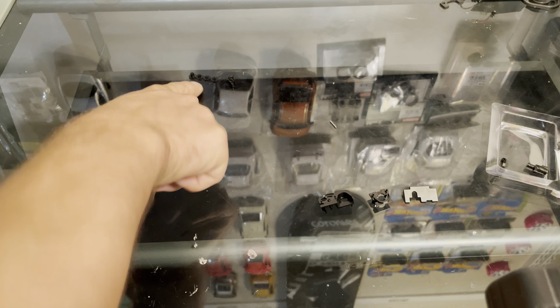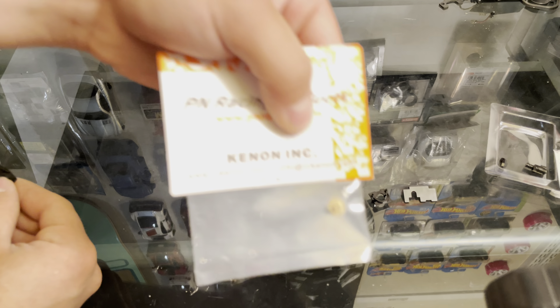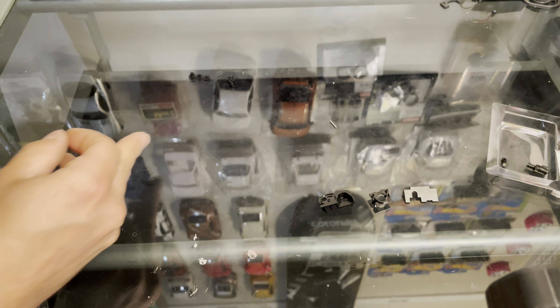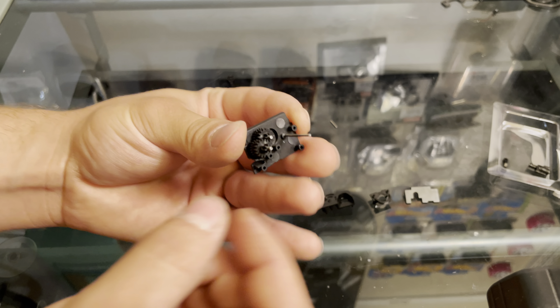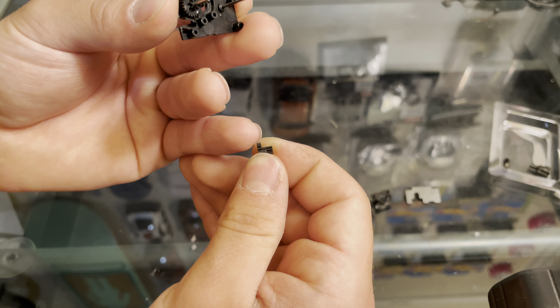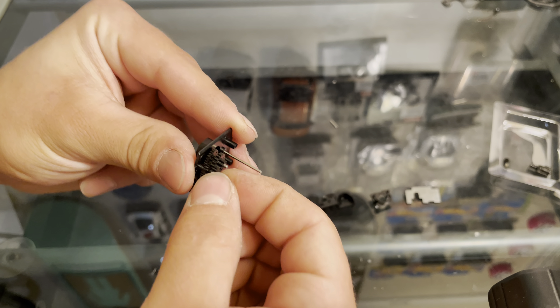There are four gears and you can use delrin or brass. You'll take the large diameter gear with the shortest height — the shortest of the large diameter gear of the four gears goes in the middle first. Then you go to the next one, and the next, and the next. The last and biggest diameter gear is also the tallest. That's the brass one if you're doing brass gears. It should spin really smooth and free.